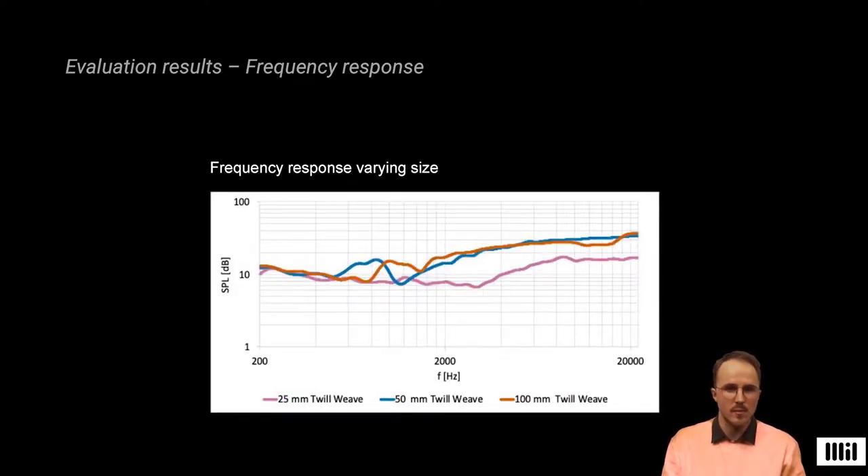In this chart, we compare different coil sizes. We can see that in our case bigger coils do not automatically yield louder speakers. A small coil of 25 mm, on the other hand, allows too little coil windings. A good middle ground we found to be at 50 mm diameter with a turn spacing of 0.25 mm.